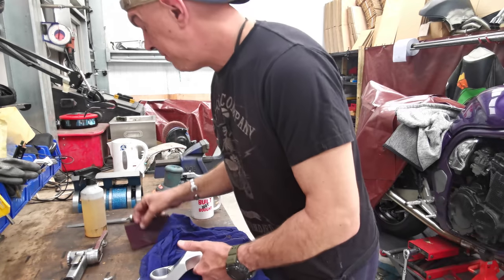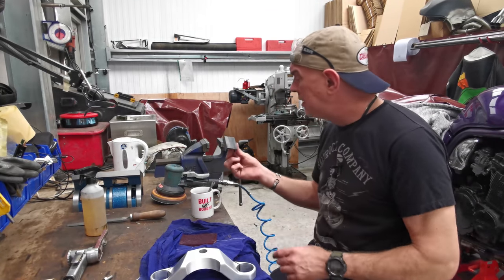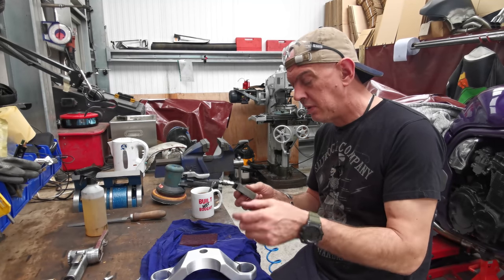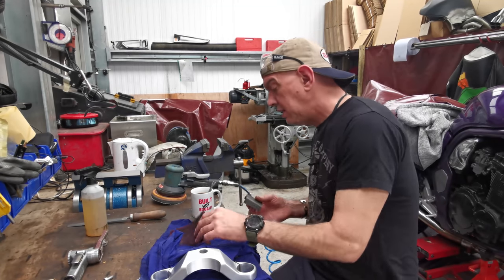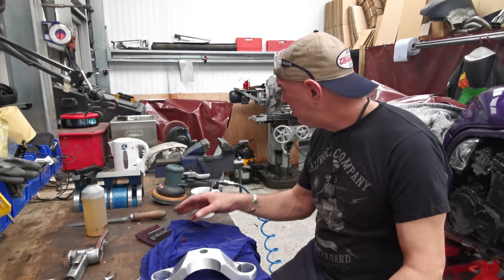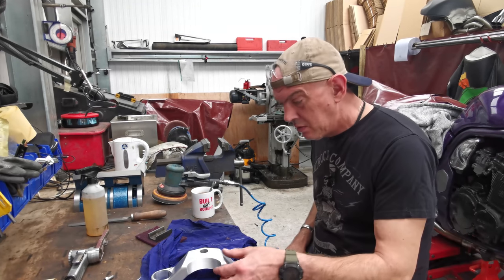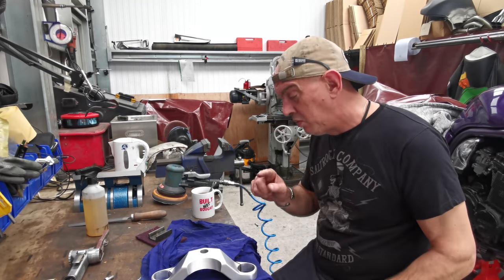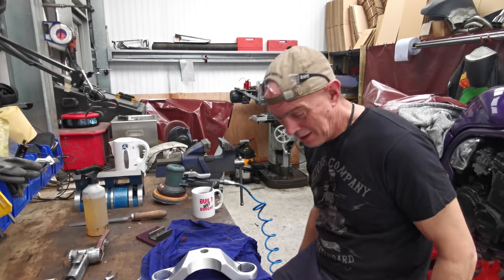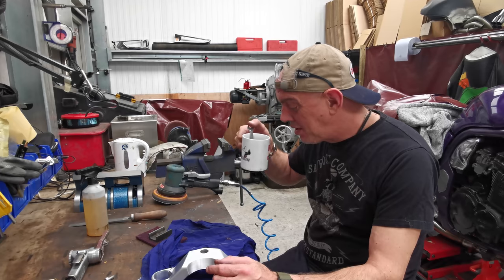And then I'm just going over it by hand with some Scotch-Brite and WD-40 on a block. Just got a piece of angle, because it's got a radius to it as well, so I'm getting to some of the corners. And it's just a case of keep doing that, basically. I would use the Scotch-Brite wheel, but that thing, when it's spinning, is actually quite aggressive. And I want all my roundy bits where I put them, not where they ended up. So, I reckon it's got...